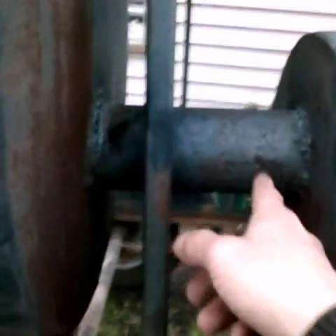We're going to get all that fixed. This is that burn box. It'll all look different. I'm going to get all this lip and get all the stuff off of here. I'm going to weld this door back down. Apparently they just cut the end off of this tank, capped them both, and put this pipe in between — that probably wasn't a good idea. I'll weld this back shut, redo the door on the other side, square them all off, take those doors off, redo the whole thing. It'll look completely different. It's going to be five or six parts to this video probably to get it all in.